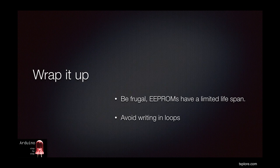In general, it is a really bad idea to put write calls to the EEPROM in a loop, as it is possible to burn out those bytes in a few minutes. There is a big reason behind only playing with the EEPROM inside the setup function in the demos of this lecture, never inside the loop function.